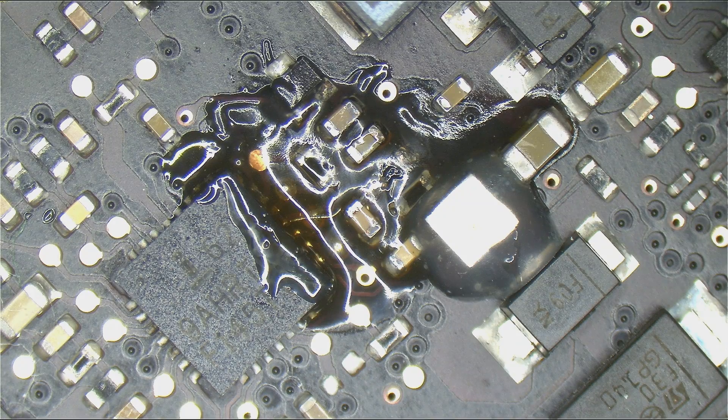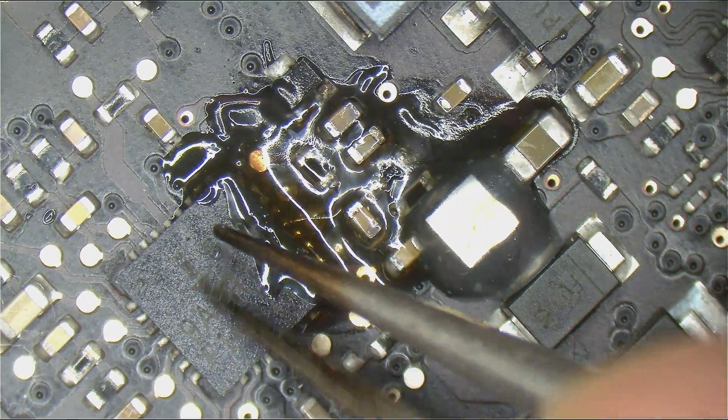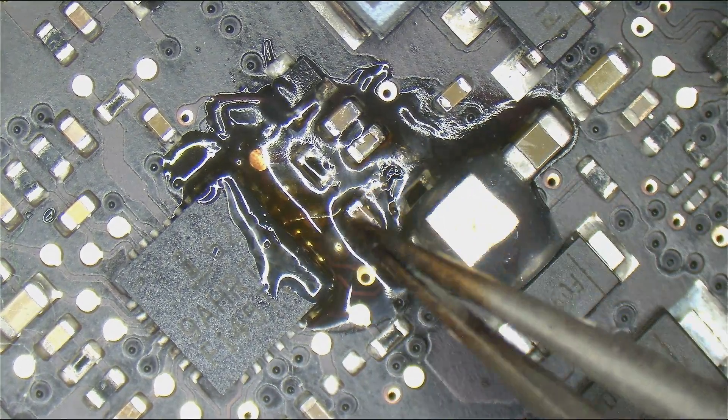All you have to do is look and run a wire. The thing that really kills me - and this is going to go through the ultrasonic cleaner, so trolls can relax - is when a company will say that doesn't look good, let's replace that. And if they're feeling generous, they'll replace the resistor. But nobody checks the pathway. If you don't check the pathway and it looks like complete crap, what do you think is going to happen when that gets back to the customer? What do you think is going to happen when that machine makes its way back across the country? It's going to fail. You tap the board, and that little degraded trace made of corrosion is going to disintegrate and die, and it won't work. But it will work if you do this stuff properly.